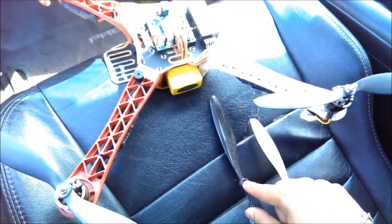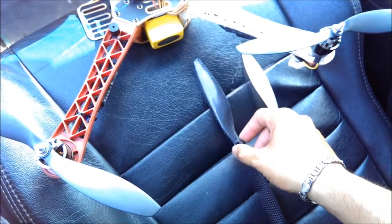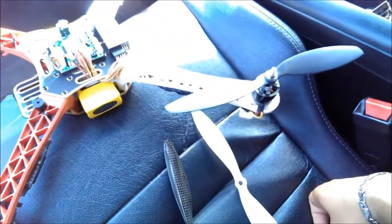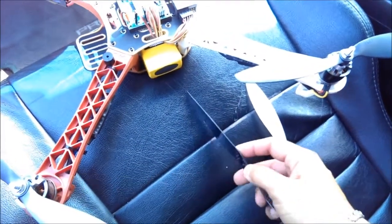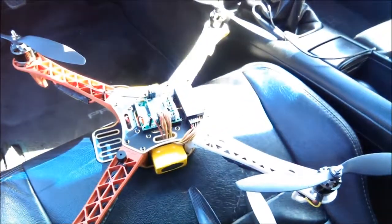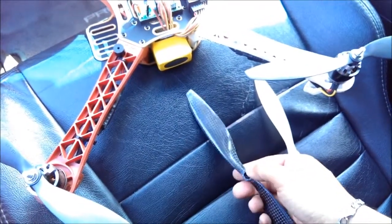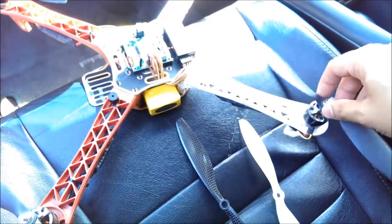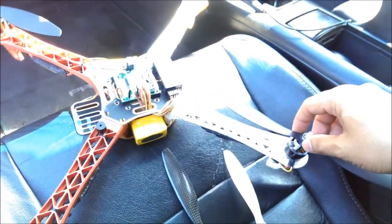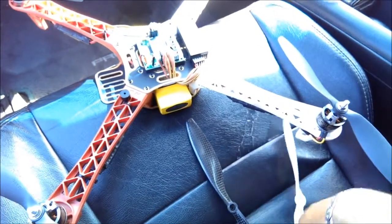These are very good props. The 10-inch versus the 9-inch — there's a huge difference. With these props on these same motors — the NTM 28-26 1000KV short shaft version — it's more responsive, more punchy, and seems to be able to change directions a lot faster. I didn't really notice any difference in battery life, maybe because these are 10-inch versus 9-inch. I didn't do a ton of testing, but I didn't see any noticeable difference in flight time. I'm going to go ahead and try out the carbon fiber and nylon mixed 9 by 4.7 props and do a comparison.